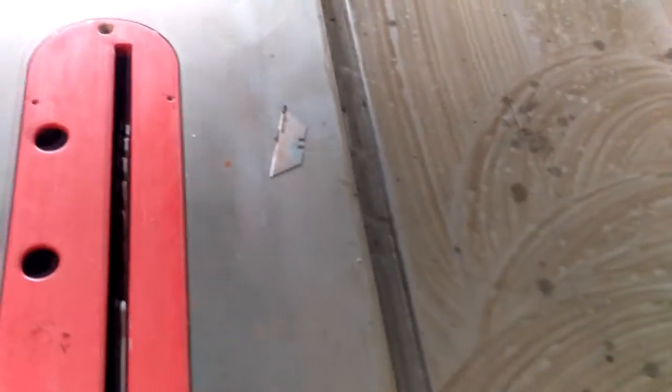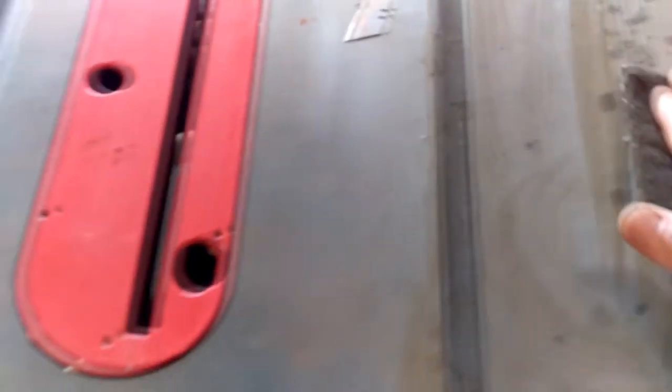On a table saw with an iron tabletop like this cast iron top, it's a machine surface. You want to be really careful about using things like steel wool unless it's very, very fine steel wool, or any kind of grinder or wheel, because you can really tear up a table quickly with those kinds of things. These dark spots may be ugly but they're not hurting anything as long as they're not sticking up and interfering with your work. There's also a grain to this iron — and to an aluminum top if you have one — so I would avoid using anything orbital like an orbital sander. Stick to going back and forth to keep that grain nice and pretty.